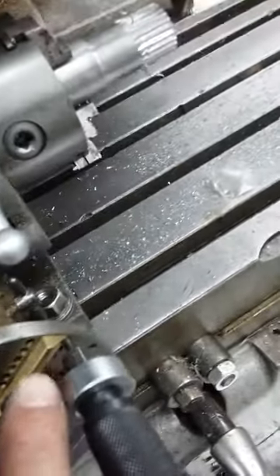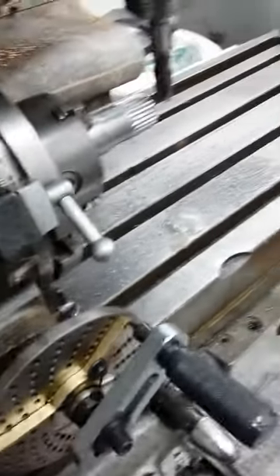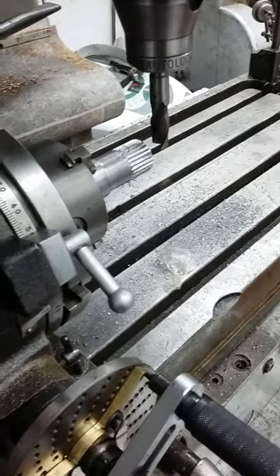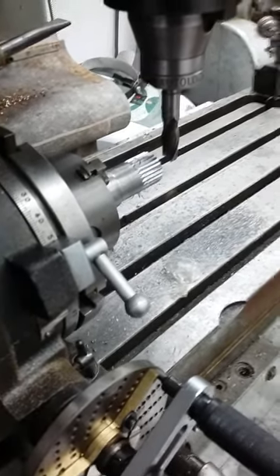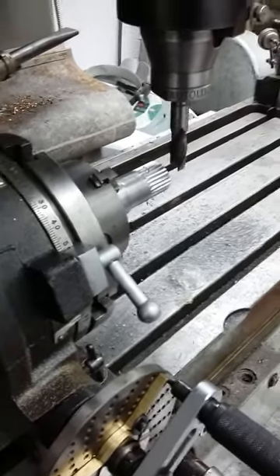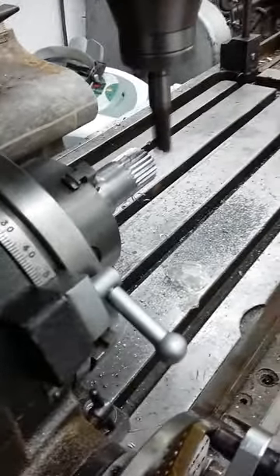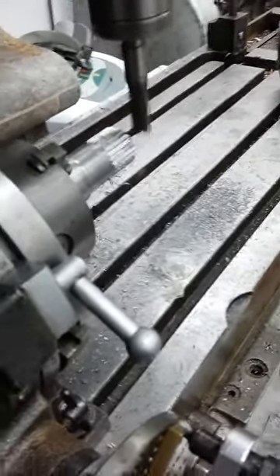To start off, you put the finger against the detent to start the cut, then start the machine up. I'm going to wind the feed in to put the cut through and then wind it on to the next one to show you how that's done. As you can tell, this is not the first cut on this shaft — we're edging into the right size. So we start the machine, we've got this lined up, the rotary table is locked so we can just feed it in. I've already done that cut, so we just feed it back out again.